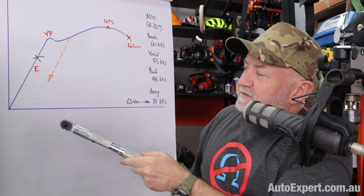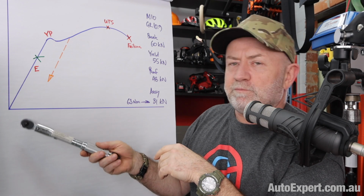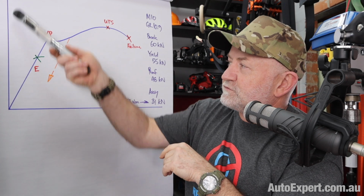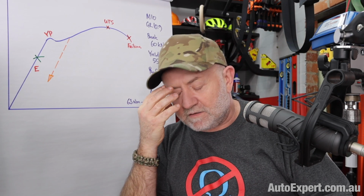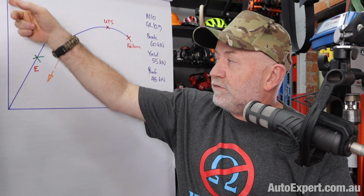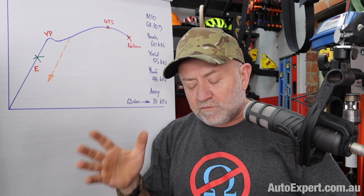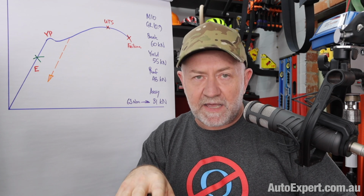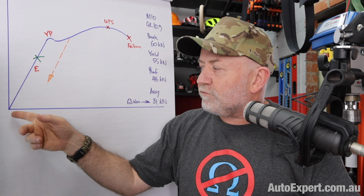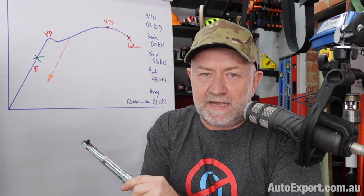Okay, so basically, this is the guidebook about how to break anything made of steel. When you break a piece of steel, this is a graph, and it's strain across here and stress up here, and all of a sudden everyone's going, oh, Jesus, stress and strain, what's that? Just think about it like stretch and load. Because that's basically what it is. And I know if you've been through the education mill as I have, you'll know that it's not really stretch and load. Stress and strain are slightly different than that. But for everyone else, they're tantamount to that.